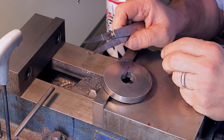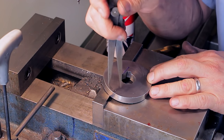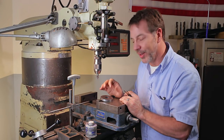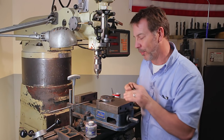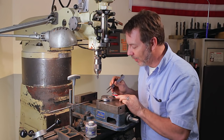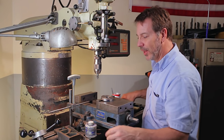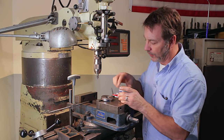You could set it up from the inside or from the outside, and that's really useful in a situation where you don't have a reliable center to go off of. You could make a center for it, but again you're adding more labor. Another way to do it is put it on your lathe and just cut a line right where you need it — very simple. So the next step is we've got one of our baselines taken care of for the marking.